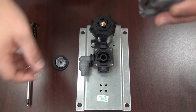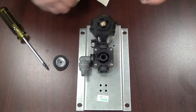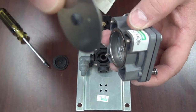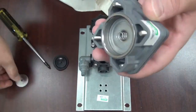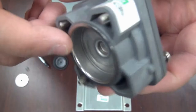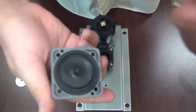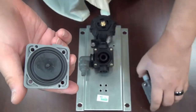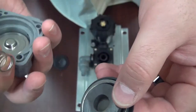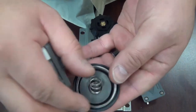Underneath the servo motor you have the pilot orifice plate — stainless steel with rubber pieces on both sides, one flat and one cone shaped. Below you have the pilot orifice plate spring. Then you have the actuator cup. Take off the cap and inside you'll see it's bare on the top side. Then you have the actuator direct acting diaphragm with magnet and diaphragm spring. The spring goes in the center of the diaphragm like so.